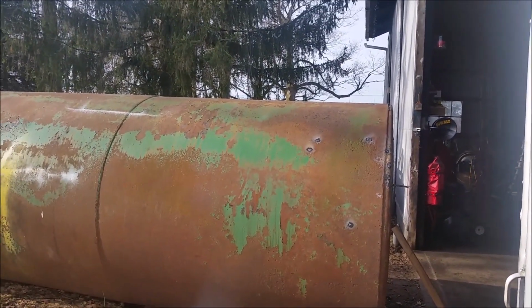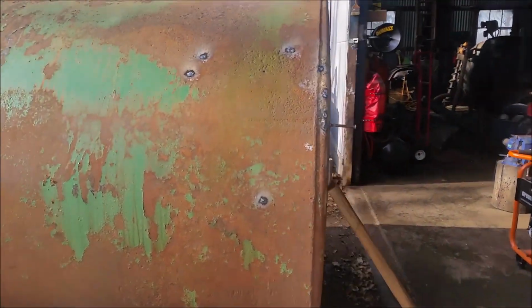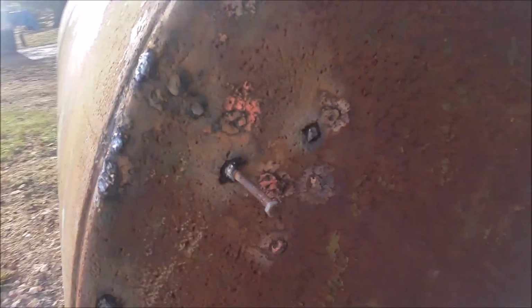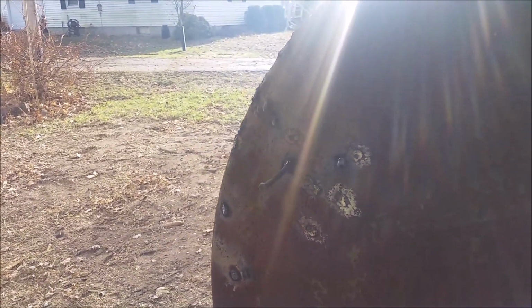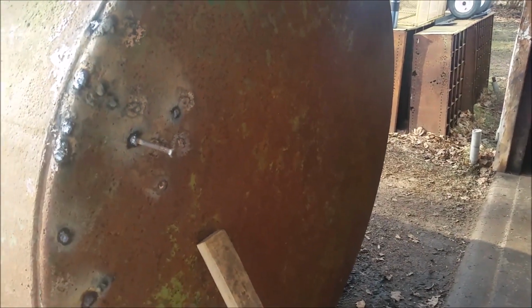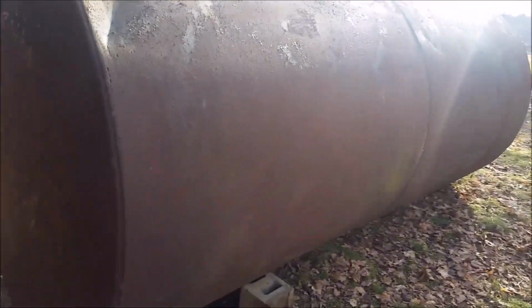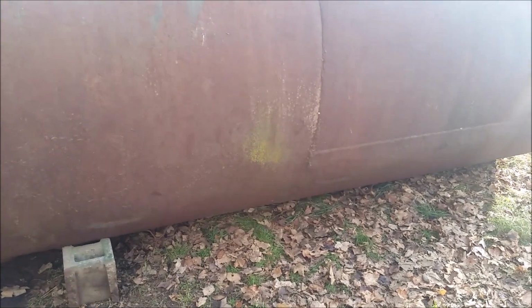Old-fashioned kind of thing. Looks like he had a bigger hole here to patch. You're gonna just cut that off? Using it as a plug? No, that's your ground. Weld it. There's no place on the tank to hook to unless you come way over here and hook to one of the lifting hooks. That was too far from my cabling. So I just weld a bolt on it, then grind it off and move on. That's smart. Yep, as long as nobody walks into it. Then you just grind it off when you're done.